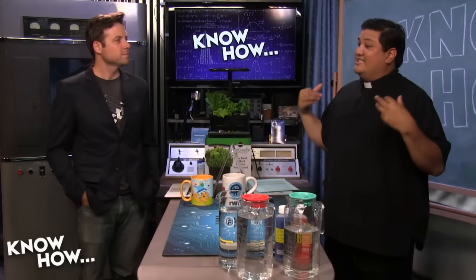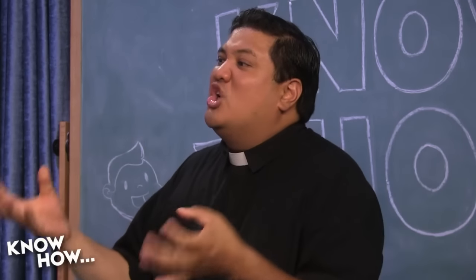We're going to look at a couple of different ways to get rid of dissolved solids. Salt and similar minerals really only come out with a reverse osmosis filter. I have a high-capacity RO filter, but I didn't want to use it until we get to the hydroponics episodes because I didn't want people to have to buy a $500 piece of equipment. So instead, we tried to get rid of the easiest thing — the chlorine. You can let it evaporate by filling up five-gallon buckets and letting them sit for a week.